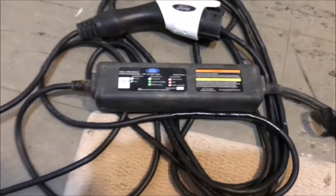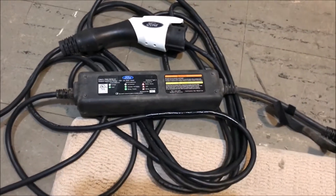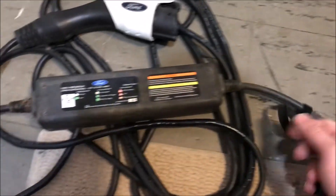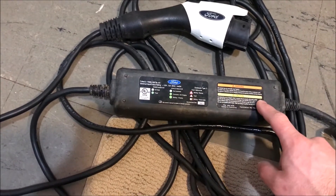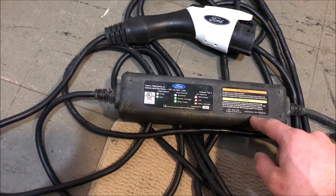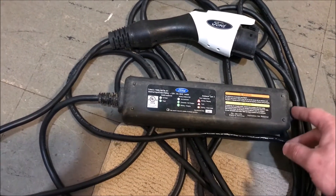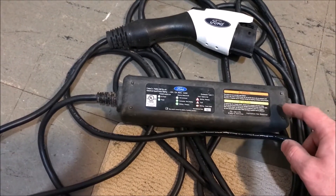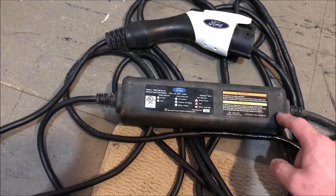You may have read that in some cases these EVSEs can run on 240 volt as well if you adapt the plug. In the case of these Ford units there's a switch mode power supply inside, so the circuit board and the power supply will always support 240 volt. However, most EVSEs include a MOV — which is what makes a surge suppressor a surge suppressor — and in the 120 volt only units that MOV essentially goes short at 150 volts.